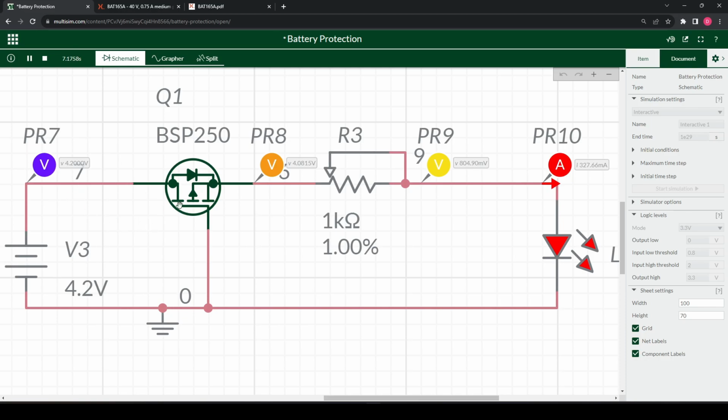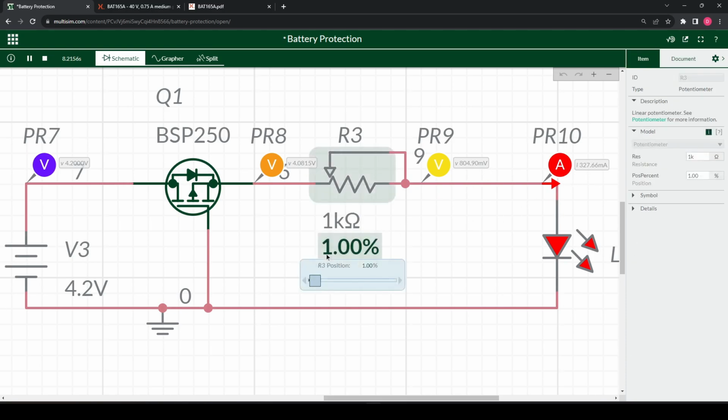And it's for reasons that, well, I'll show you here. We have 4.2, about a 0.2 volt drop, and we're getting about 327 milliamps out. Though if we reduce the current, we barely get a noticeable drop in this application. So for simple things, it's really not too bad.